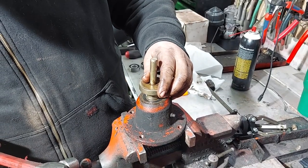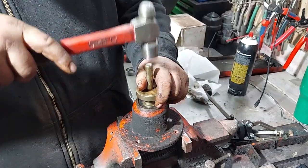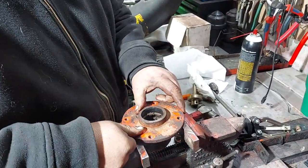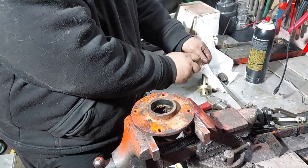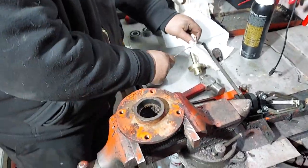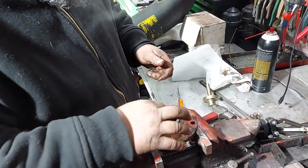Now I'm just going to turn this over — it's going to be on the inner race, but there's not a lot of force here right now, so just tap it lightly and you'll hear and feel it bottom out against the snap ring. Flip it over and make sure you're clean in there — no rust or anything. Make sure your housing is smooth since the bearing is going to ride in there. This grease is good so I'm not worried about getting it really clean.